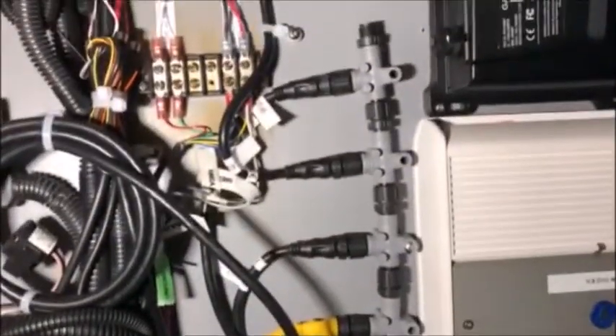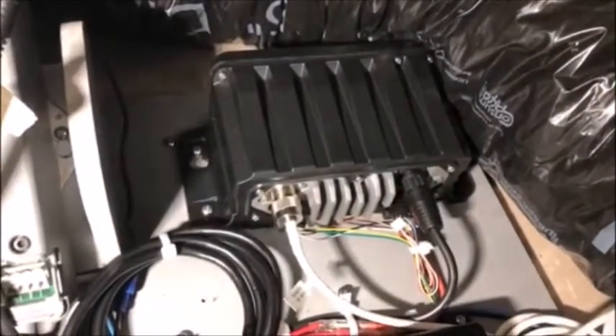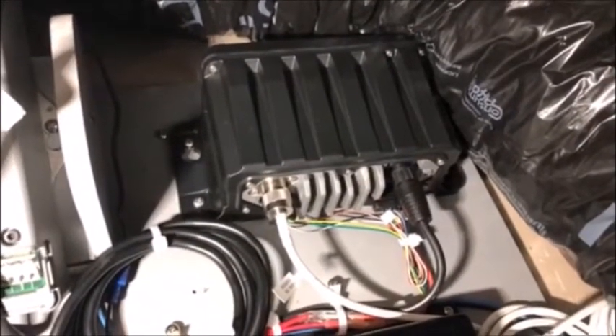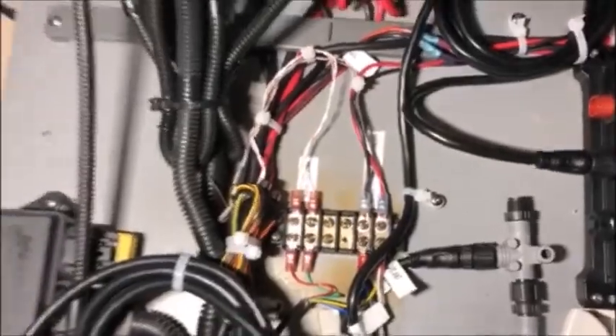Coming up here to the helm — you can see inside, it's a little dark, sorry I don't have my portable light. We've got the AIS unit installed. We started to put in our NMEA 2000 network — everything labeled so you know what it is. There's the AIS. Moved the stereo amp down a little bit to accommodate that. Got the ICOM 400 black box up top, and our NMEA 183 network is still there. Making progress — we've got the ceiling back up and all the work on the hardtop is complete.